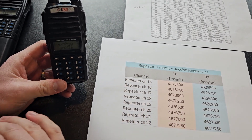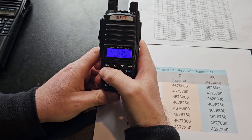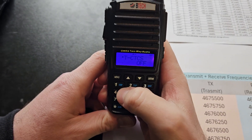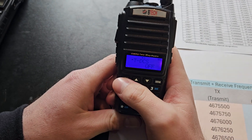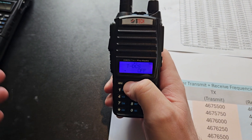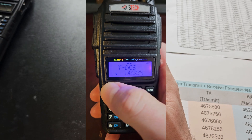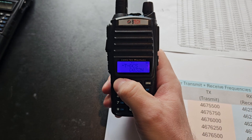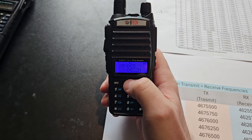The repeater will now pick up that tone and hear it. Let's also do a digital tone. We'll zero out the CTCSS tone and turn it off, then go up to a digital transmit tone — it's exactly the same. If there is a digital tone on the repeater's intake, you just set your transmit tone to whatever it is. So if it's 3-2, you set it there and confirm it the same way you would any other tone in the radio.